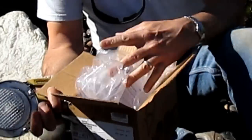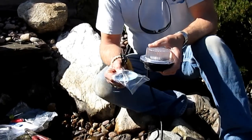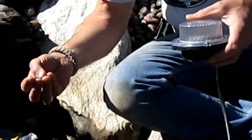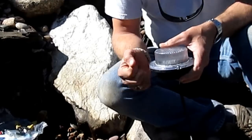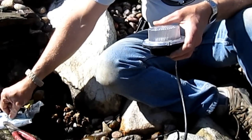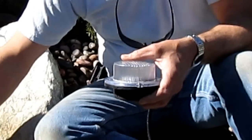Inside of the box, you're going to have a light that's well-packaged and well put together. It comes with a little small package that has a lighting baffle plate and some silicone-filled wire nuts. Those are fine in the field and most people use them. Myself, I like to do something a little more long-term and I'll use some small electrical connectors with some heat-shrink tubing. We're going to crimp these together for the long haul because these wire nuts can come off and get bumped off, and you're only as good as the last tightness of the turn that you make on your connections.